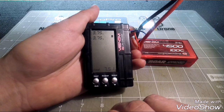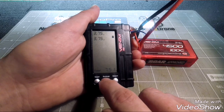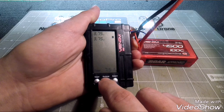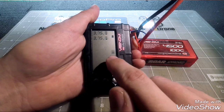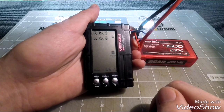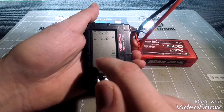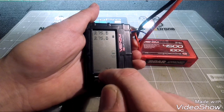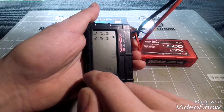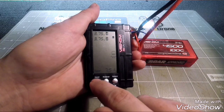This pack looks to be very well balanced. To start discharging, press and hold the discharge button for about three and a half to four seconds, then release. You'll see an indicator on the right showing it's entered discharge mode, and each cell is being discharged. In the old days we'd hook up incandescent light bulbs in series to fully drain NiMH batteries, but this intelligent unit knows it's lithium polymer and will only discharge it to that 3.2 volts — about 0.5 volts per cell in this case.